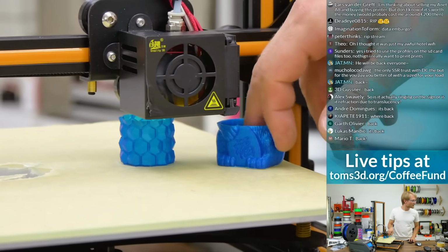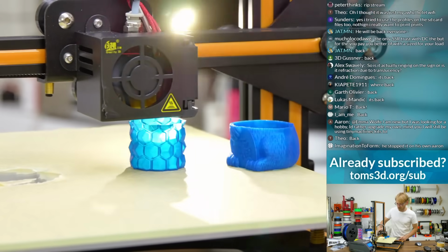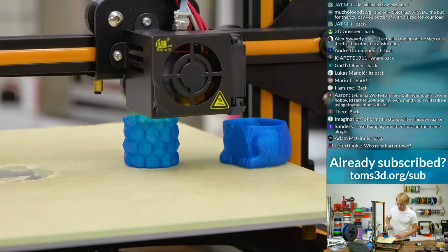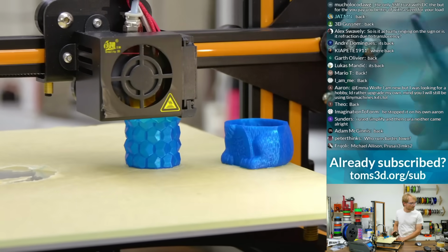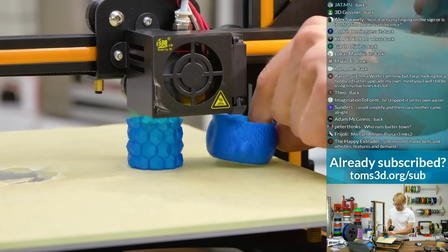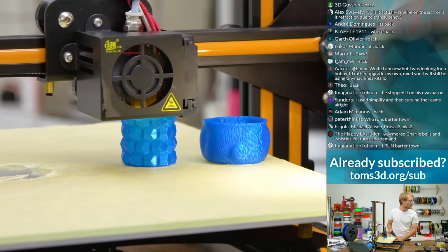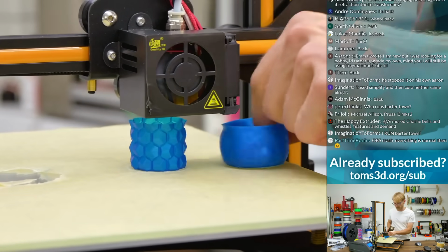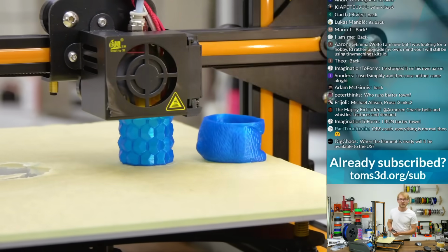Is this ringing or is this refraction? This is not ringing. Well, let me put the light back. You don't really see it. The cat, I guess we can get the sheen on it. That is actually fur texture. That is intentional. This texture on the cat right there, that is 100% intentional. That is not ringing. That is not anything that the printer created. It is from the G-code. That is as sliced.